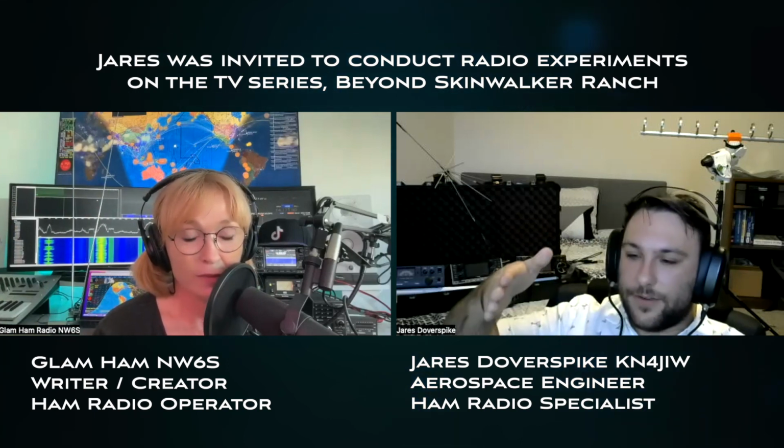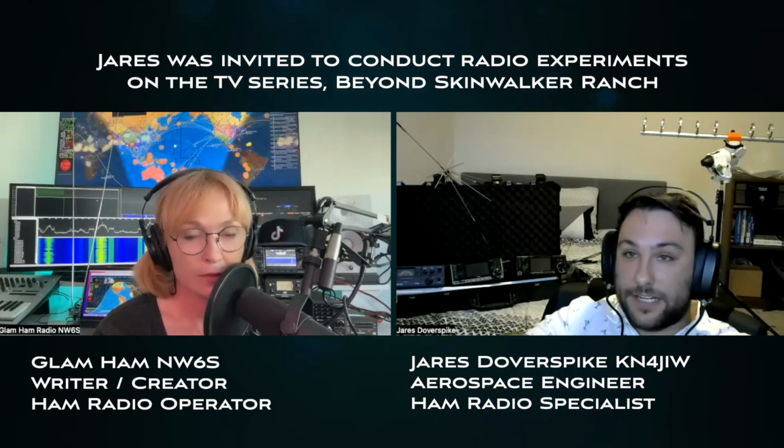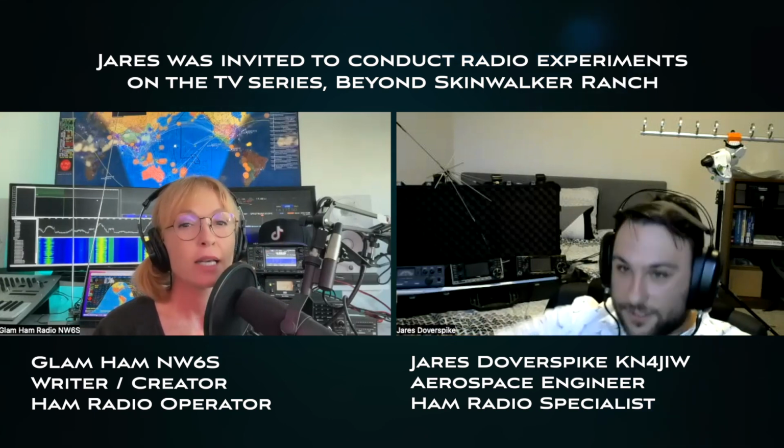How do you calculate where the ping is going to be of your signal? With harmonics, there's two ways of doing it. You can either look at harmonics up, or harmonics down. It's really simple. Say 100 megahertz, and you want to figure out what the different harmonics are. You have your base frequency. The first harmonic is N plus one as your multiplier, so it's two times the original signal: 200 megahertz. The next one's going to be triple, the next one four times, and so on and so forth.